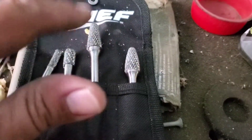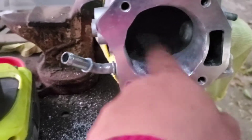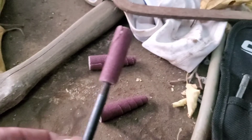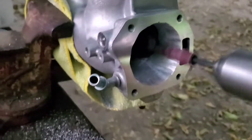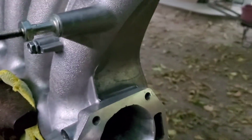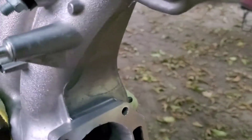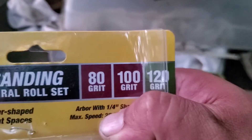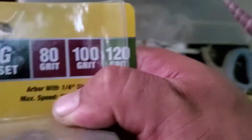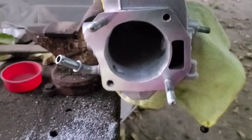This is the one I was cutting with — I'm giving it a cleaner finish. I have these sandpaper discs that I've never used, brand new in the package. I think this is the most aggressive one, and then it goes up to 100 and then 120, so we're doing 80, then 100, and then 120.